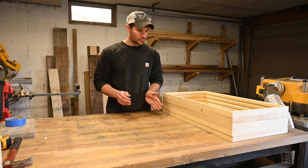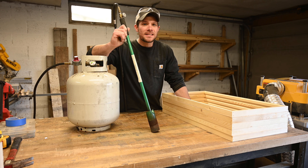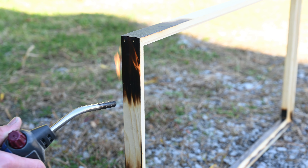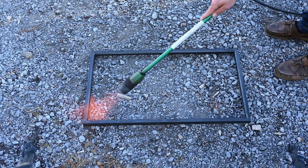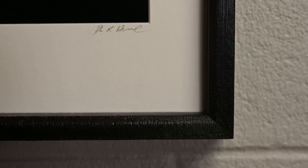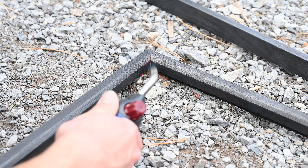Then it was on to the most exciting part — torching them. I'm not going to paint them or stain them; I'm basically going to set them on fire. There is a way of burning wood with a torch that just browns it and brings out the grain a little bit, but that's not the look I was going for — I wanted to go way past that. I wanted them to look like a textured piece of burnt wood, basically like alligator skin. I was originally worried this would warp the frame, but it turned out really nice. The big torch worked well, and for where the miters went together, I used a smaller propane torch to get into those areas.